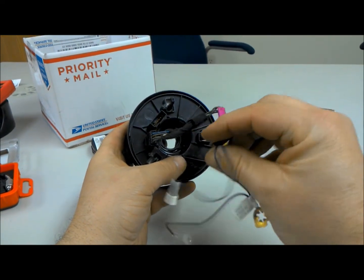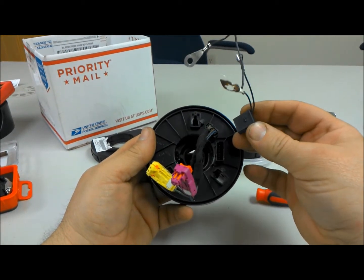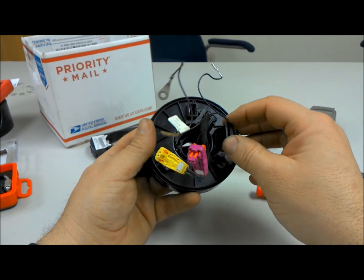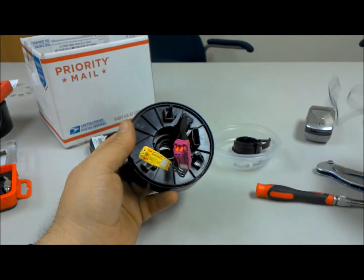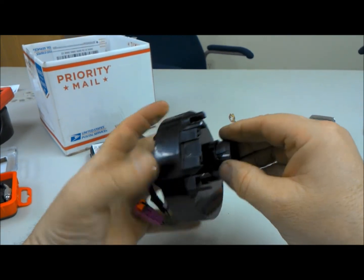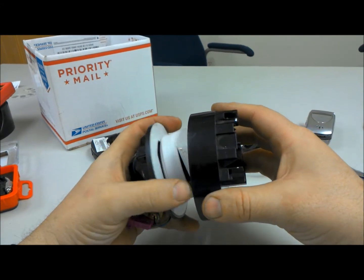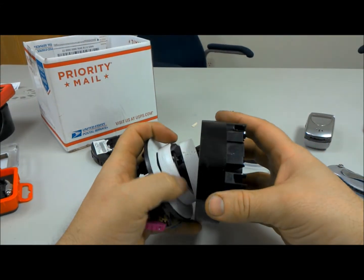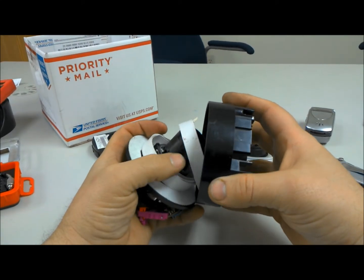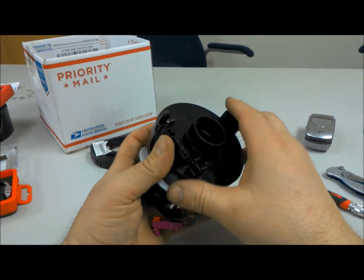As much as I can figure out. The way this goes is in here like this — you see there's a little connector there, and that snaps in that little jog there, so it goes in there like that. When you open this up, what you have is a ribbon cable. I've scratched the insulation off because the wire is broken here — the ribbon cable is broke. But I went through and did the pin-outs on all of those, so I know which one of those hooks to which connector.